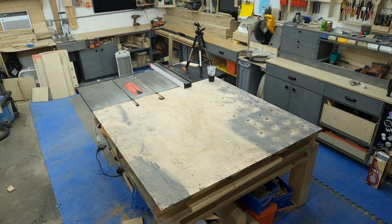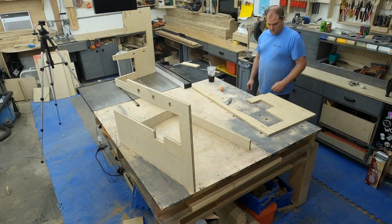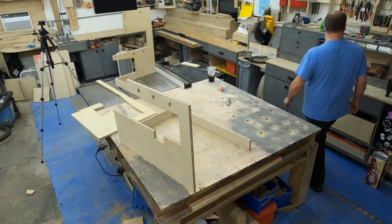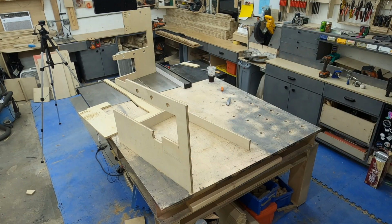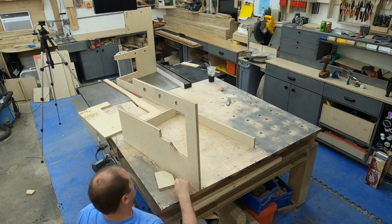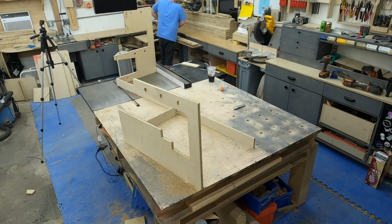So, this particular layout was really bad for wasting plywood. So it was a lot of plywood use. The final count, just in 1/4-inch plywood, for example, is 21 sheets of plywood. And then the 3/4-inch stuff, which was all these frames are made out of, is another roughly 20 sheets. So, building in this manner is not the most efficient as far as material use, and I openly admit that. But what it does do is it provides a very strong modular framework that minimizes the need for legs.